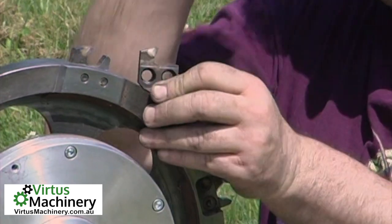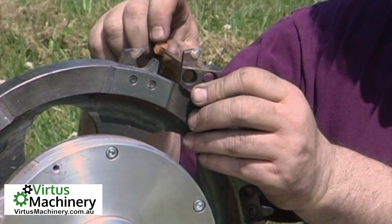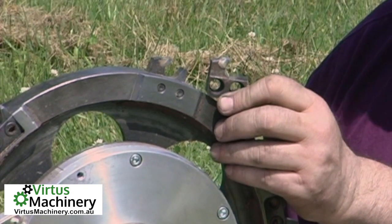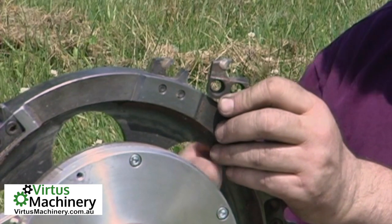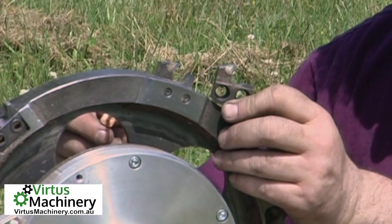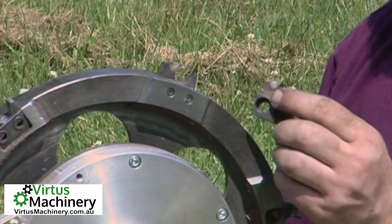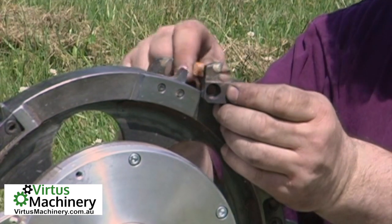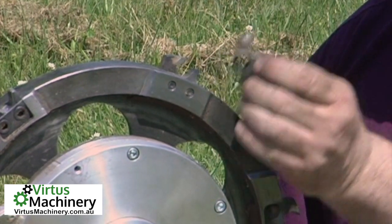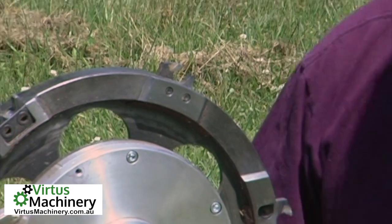And you can see the difference here between one that is great for grinding wood versus one that we're going to use for taking dirt out of a trench. Again, these are dull teeth. These are teeth that I wouldn't even consider good enough to grind a stump. So I'm trying to get the most out of the cost of purchasing a set of teeth by using them for grinding stumps to start with, and when they get pretty bad, turning them into a set of teeth that you can do trenches with. Sometimes I don't even grind these riders off, I'll leave them intact, but in this case I want to show what maximum performance can be. If you grind that rider off, and all you're going to be doing is digging in dirt, this is the way to get the best production.